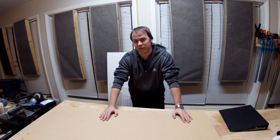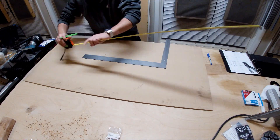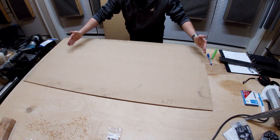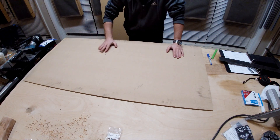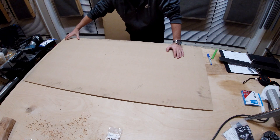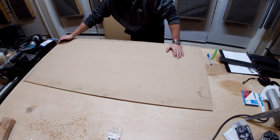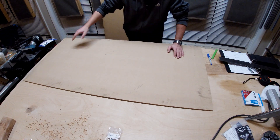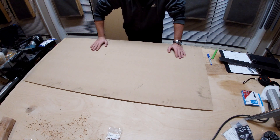I'm going to mark it out and we're going to cut it. So to walk you through what I've done: this is going to be 15 inches tall by 40.5 inches wide. This panel and this panel are going to be cut off and used as essentially end plates. One of these — probably this guy because it's skinnier — is going to be cut down to six inches wide. I'd like to get this straight edge cut, then measure off of this edge and not this one because this one's not so straight. We're going to cut first that way, then this way — that'll give me the least amount of wasted material. I'm going to get set up and move over to the table saw.